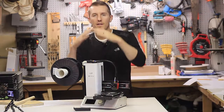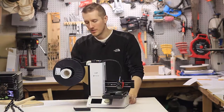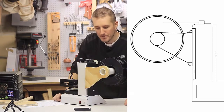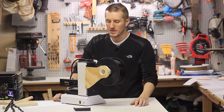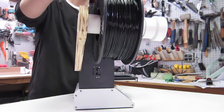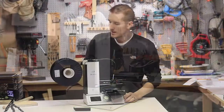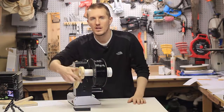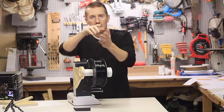For people who have this same printer, I'll do some plans. The part itself is approximately eight inches by six inches. I probably over-designed it a little because it's only holding a kilogram, so it doesn't have to be super strong. This thing has worked much better and I haven't had any problems with it binding on the filament. The PVC pipe just fits in here — I traced it, drilled, and cut it out with a jigsaw or bandsaw. I cut the groove with a handsaw to get the right depth.